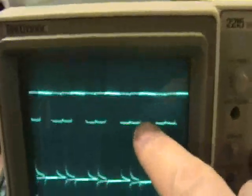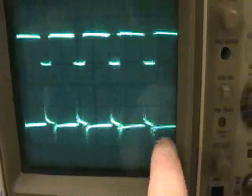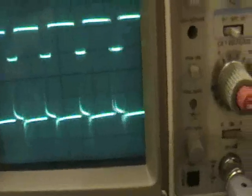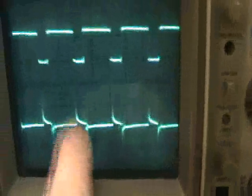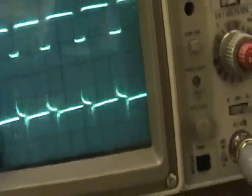This is the voltage coming into the bridge rectifier on the AC side — five volts per division, so it's about seven volts or so. And this is what's occurring on the tank circuit — two volts per division — so these are very nice spikes coming into the tank circuit here. The seconds per division is one millisecond per division.